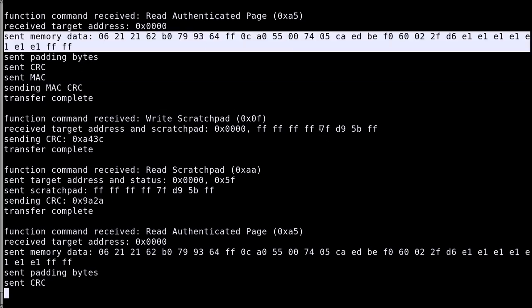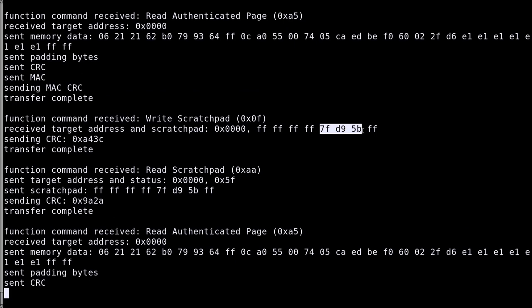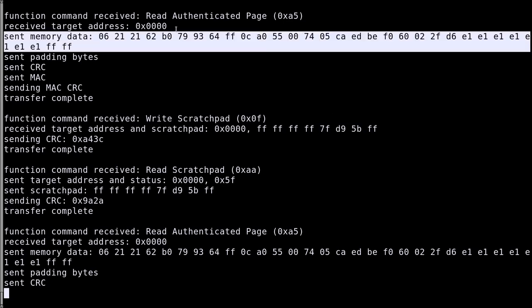There are four pages per challenge. And each challenge is 3 bytes long. So in total, you would need 1.3 gigabytes of just MAC values. It's not too much though. You could plug an SD card in your microcontroller, ask your original chip for all the data, so for all the MAC values for the four pages with this data, you can ask for the MAC, save it, and then just replay it. And this is quite a valid attack, and it would work.